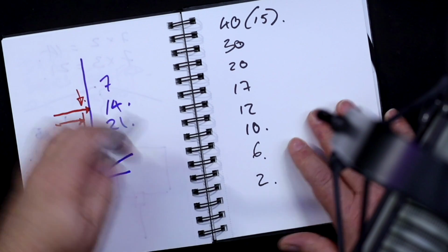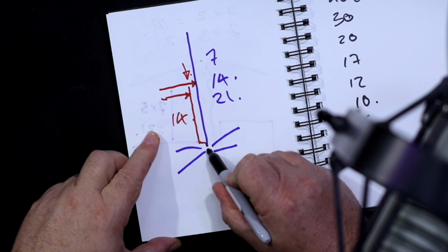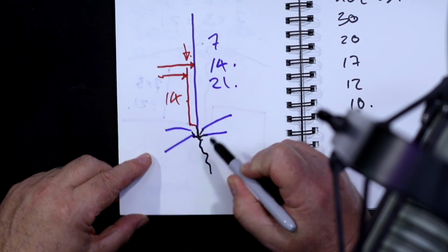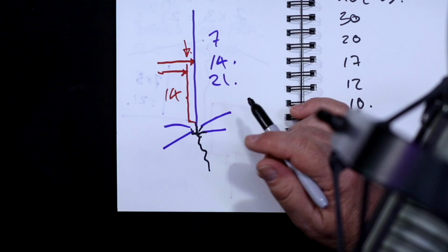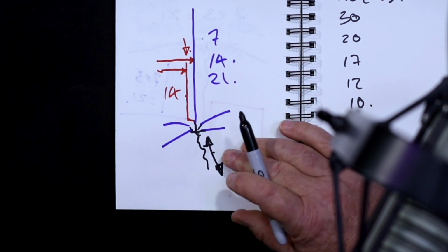And it was only when he sent me the picture, because let's look at this, right? This is a circuit where you've got your coax coming up and going straight up the middle. And then on the braid, effectively, we need to connect the radials. So if you don't connect the radials, it kind of will work in a weird way because the coax itself will act as one radial. But very often, it's not very good. But this one, I must get at least once a month. The guy eventually admits he hasn't connected the radials because he hasn't installed it in the place in the garden he wants to put it in yet. That's the fundamental error that people don't even make.